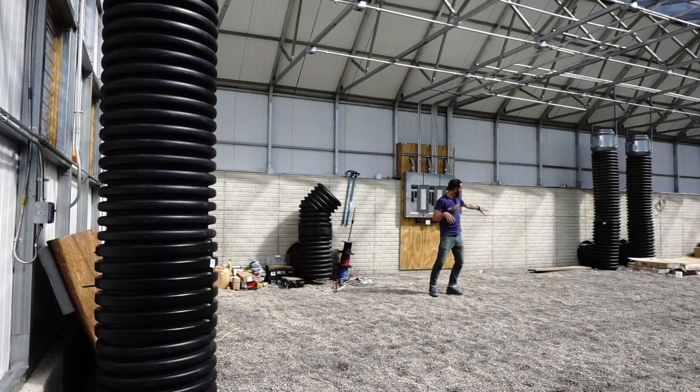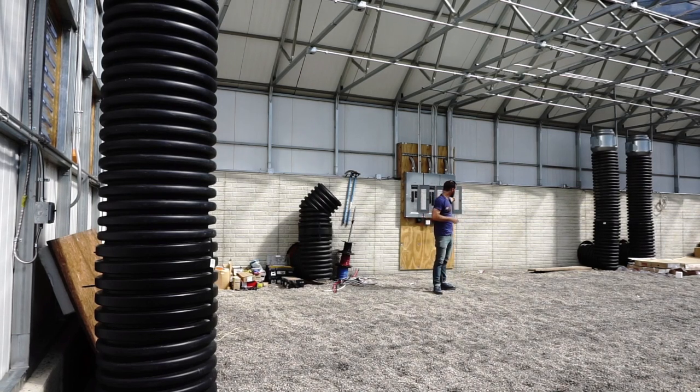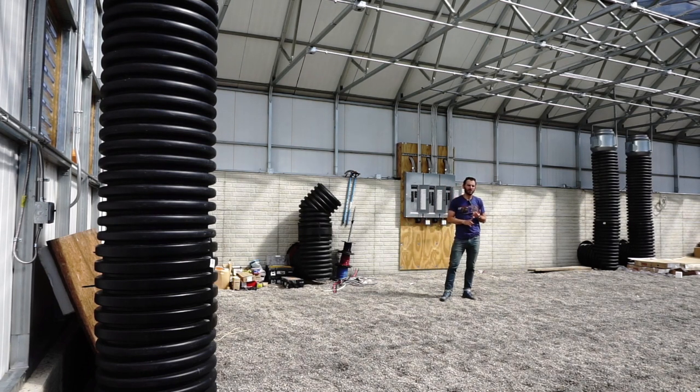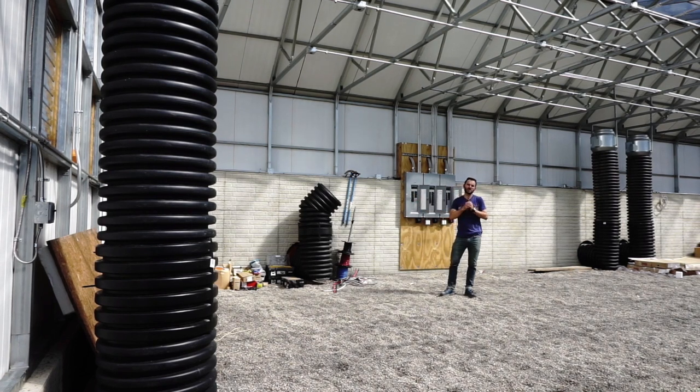One of these systems will take in air — this is probably a 5000 CFM fan. Ideally these are three phase, 480 volt. It's a highly efficient way to cool, maybe the most efficient way that there is. These go out the north wall of the greenhouse where there's an entire system buried underground. That warm air runs through cool soil, and the cool soil pulls some of the heat out of the air. If the soil is cool enough, we create a phase change — we're actually taking humidity in the air, which is water as vapor, condensing underground as it cools rapidly. That is a phase change: a chemical reaction occurs, it turns into liquid water, drains out of the system, and heat is released.